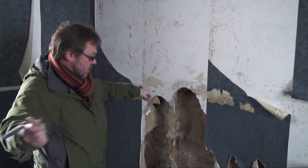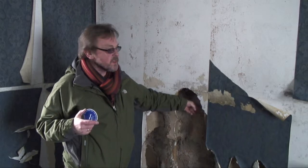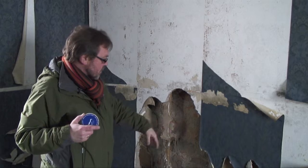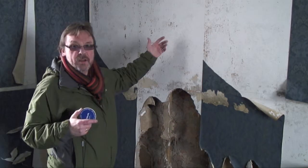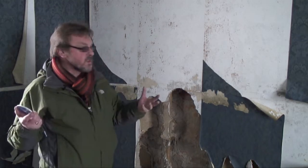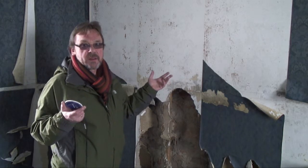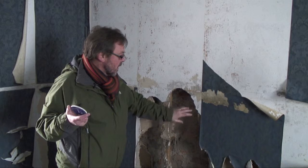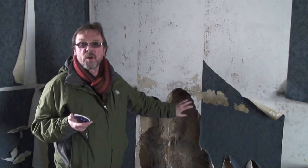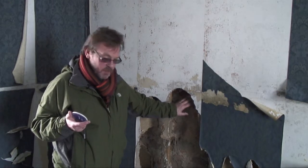I'm just about to install one of the heat flow meters onto the original wall surface here. The plasterboard has been damaged so it would make no sense taking a measurement on it, because when the room is heated you will get warm air passing up behind the plasterboard and it will give you a false reading. So we might as well take advantage of the exposed original wall surface and take a direct reading through the old construction.